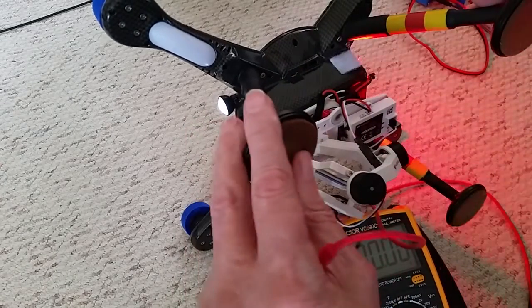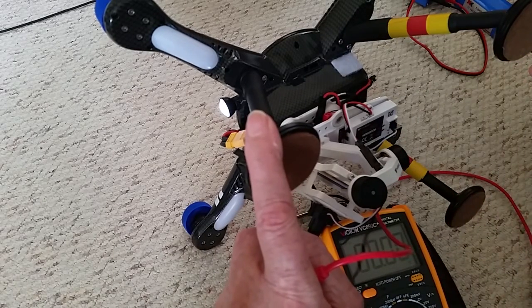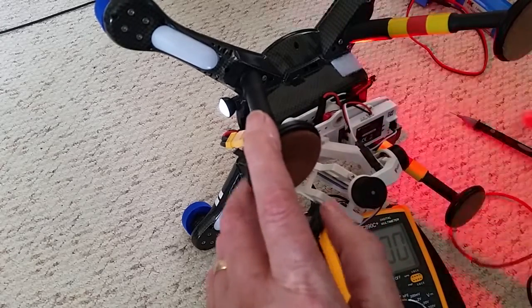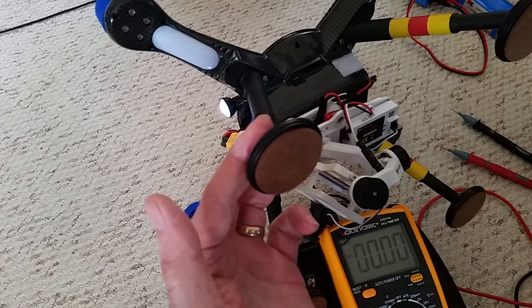That shows that my output signal from my quad is working when tested with a multimeter. If you get those sorts of readings or any voltage, then you need to look at your gimbal, because you have a fault there. If you don't get any voltage output from your quad on the signal line, then you have a problem with your quad and no signal output — you'll need to look further inside the quad. Thanks for watching, hope you can get your gimbal up and running one way or the other.